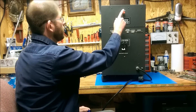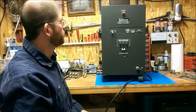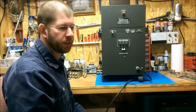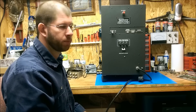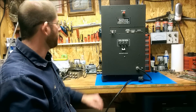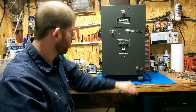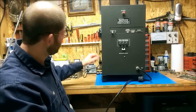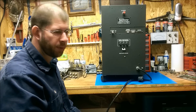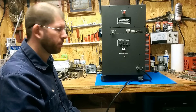Up top you can see the RF output. I went ahead and put a little CV load on there just to have some kind of termination on it, in case there might be a little bit of drive during troubleshooting — seemed like a good idea. You can see one of the issues right here is the power cable; it's all worn out, probably just due to age. You can also see it's wobbly. I think it may have been dropped. I need to get the transformer and power supply out and look at the chassis to see if I can straighten it up.